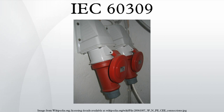The blue fittings are often used for providing weatherproofed exterior sockets for outdoor apparatus. The yellow fittings are used to provide transformer-isolated 110 V supplies for UK construction sites to reduce the risk of electric shock, and this use spills over into uses of power tools outside of the construction site environment. In camping situations, the large 32A blue fittings provide power to static caravans, whilst the smaller blue 16A version powers touring caravans and tents. The red three-phase versions are used for three-phase portable equipment.